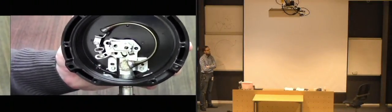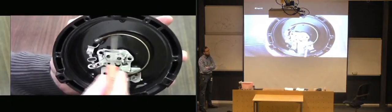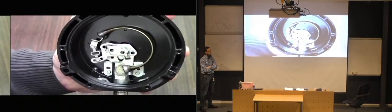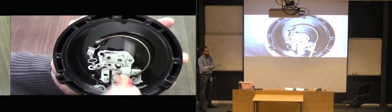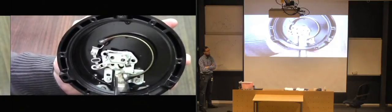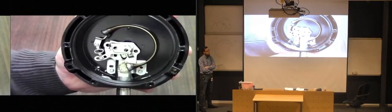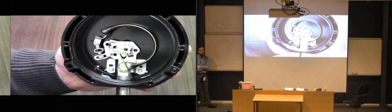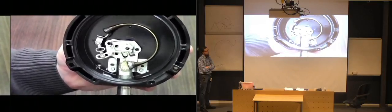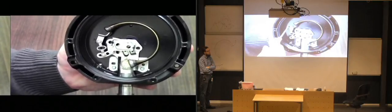Now this gauge is calibrated for 60 psi. The Bourdon tube metal and construction is designed specifically for the range. So for instance, on a 5,000 psi gauge, you might see a little bit of a thicker Bourdon tube, but ultimately the design is the same. The Bourdon tube and the socket are the only two pieces that will actually touch the media. So those are the pieces that are going to be made of brass, stainless steel, Monel or steel in some cases, all depending on how corrosive the media is or what you're trying to do. The most common being brass and stainless steel.